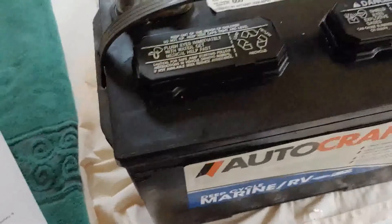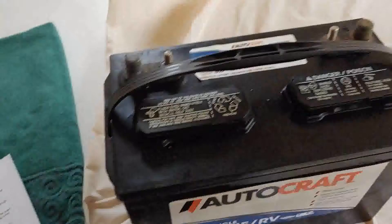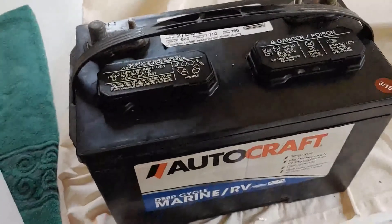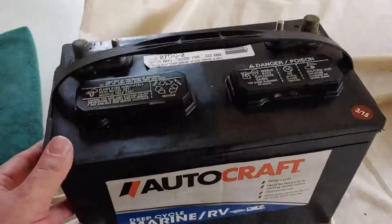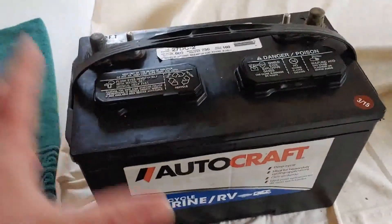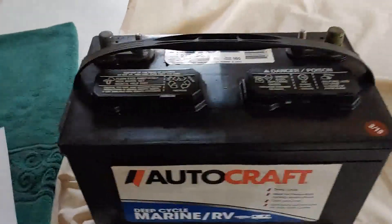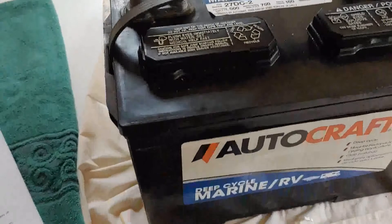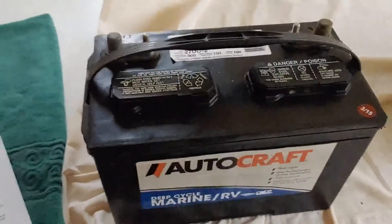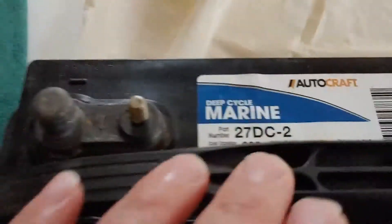You have to check water and add distilled water. Also, these batteries leak. Since they leak, you have to keep them upright at all times. You can't move them around or tip them over. Battery acid will burn you and your clothes — very important to keep that in mind. Most people know this already because they've had car batteries and know how that works.